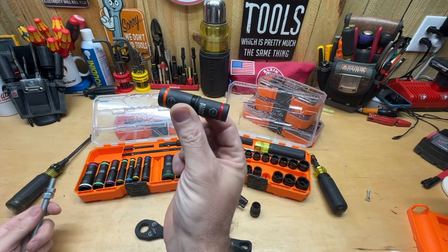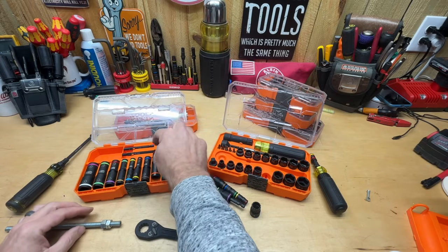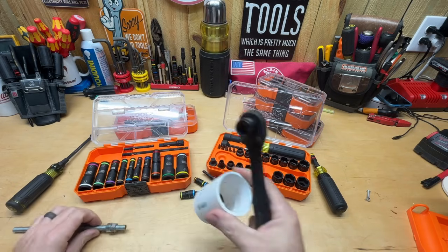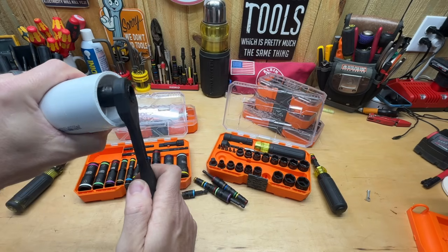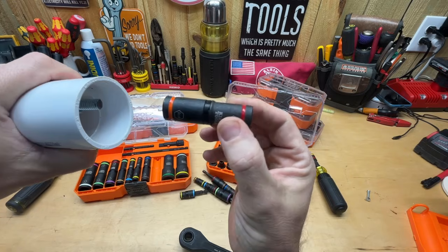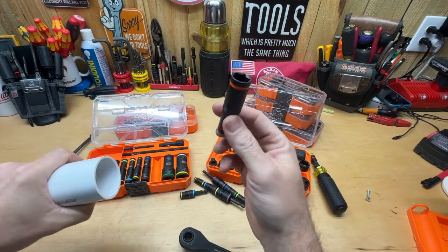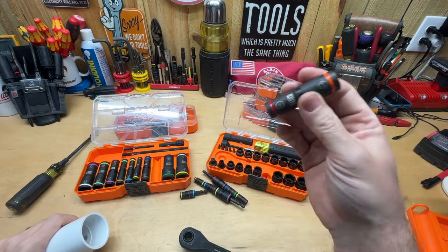I think it's an appearance thing that makes you feel like you've got a deep-well socket on the flip socket. The only advantage of a flip socket versus a pass-through is if I put this pass-through in my ratchet and I've got to get down to something way down inside somewhere — I can't get to it with the pass-through socket, whereas a deeper socket profile might let me reach it.